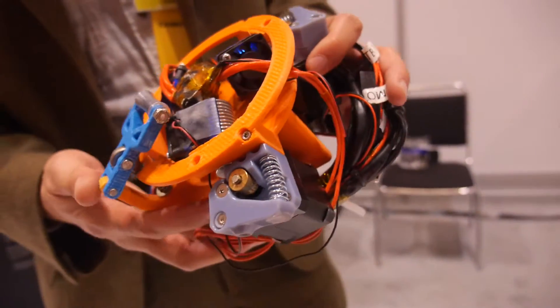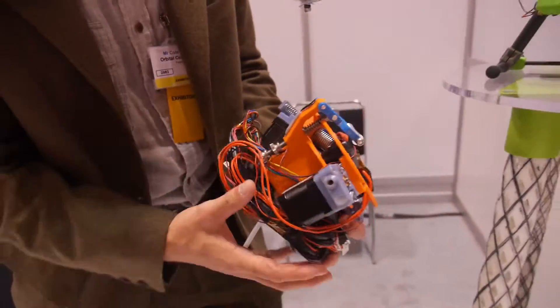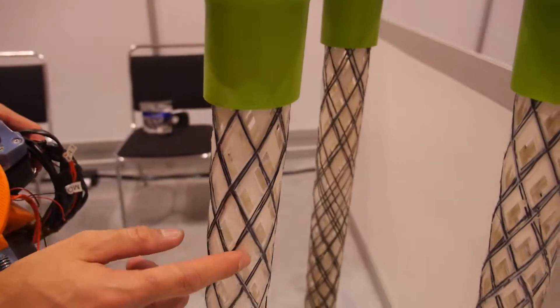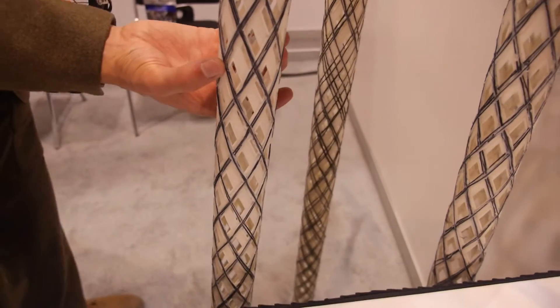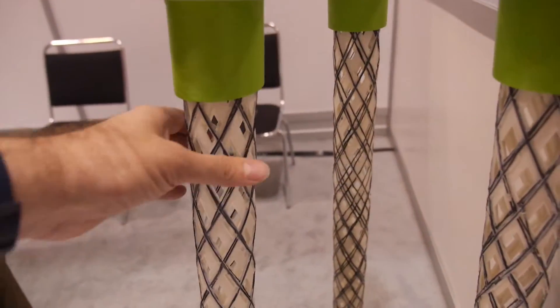So you printed the printer — the whole RepRap dream, right. We can take this tool, and that's how these tubes were made. These long carbon fiber tubes were actually wrapped using this tool. What we're looking at is carbon fiber encapsulated in ABS, wound over an ABS handle that's left in place. The stiffness of this object is extremely high.